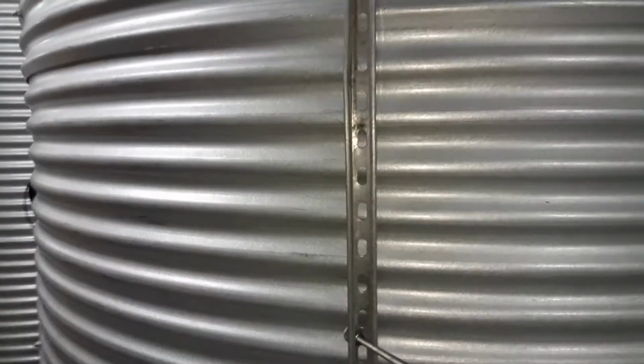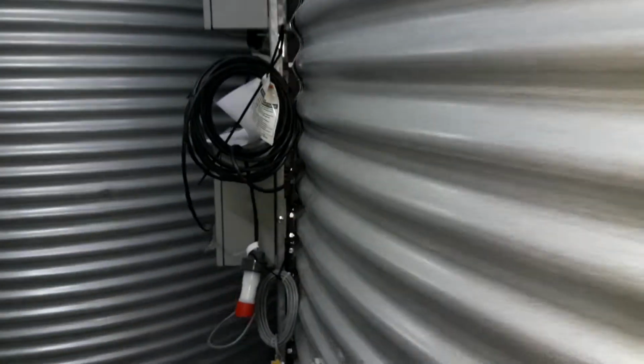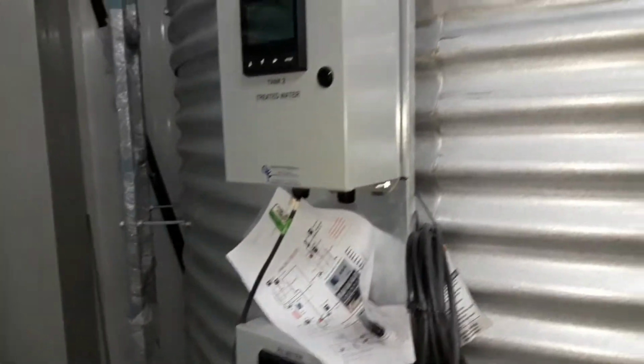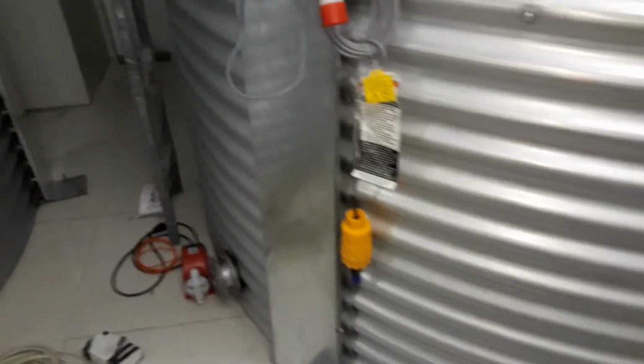It comes through the pump, one-way valve, into the second tank that is controlled for water level and also an acid injection system to control the pH level of this water, because the water in this tank is temperature controlled, pH controlled, ready for the plants.